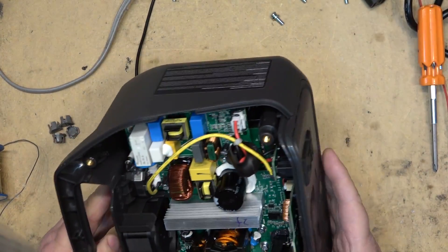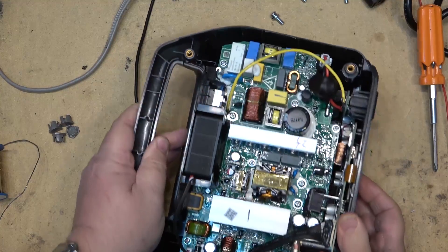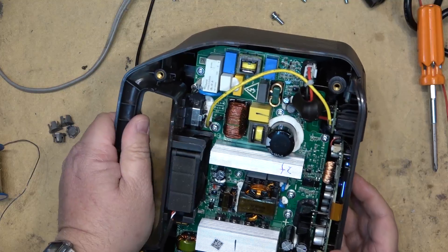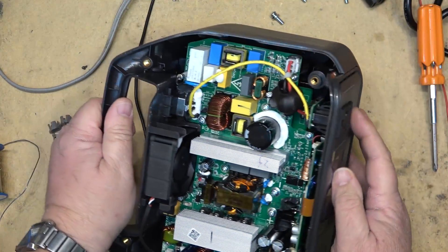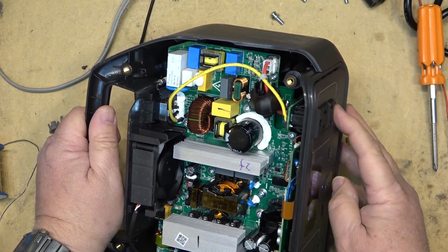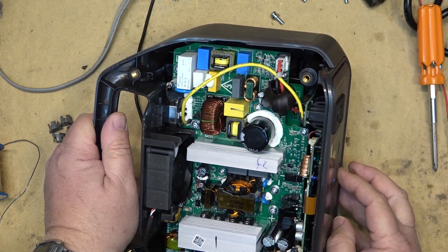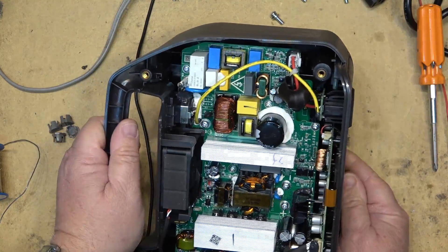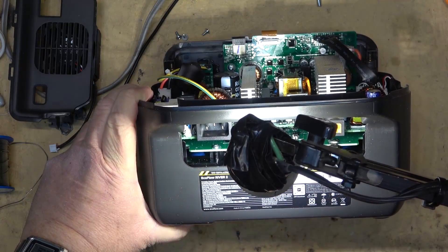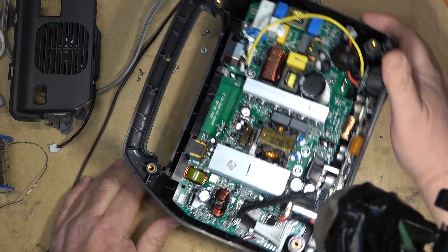Looking down at the board, the construction appears exceptional. You're going to see one large 450 volt, 180 microfarad rated capacitor — that is part of the sine wave generation circuit. It uses a DC to DC inverter: it takes the battery voltage of 12 volts, steps it up to approximately 350 volts DC, and then uses the bank of transistors mounted on the heat sink next to the filter capacitor to generate the pure sine wave AC output. You can also see the lithium iron phosphate cells below the battery management board, which sits right over top of the batteries below the main inverter board.